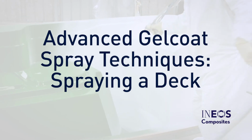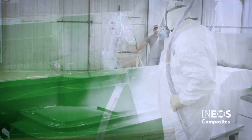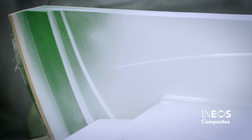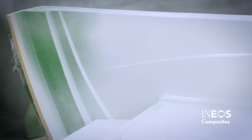Advanced gel coat spraying techniques. Spraying a deck. Spraying molds with corners and deep grooves can be a challenge. You need to be careful not to double gel coat thickness in corner areas. This will lead to the potential of porosity and cracking problems.